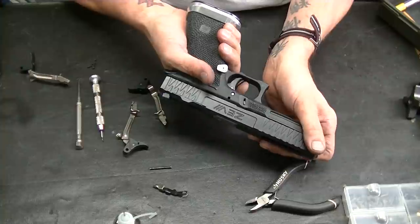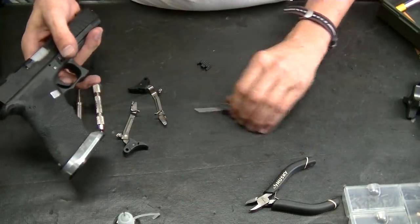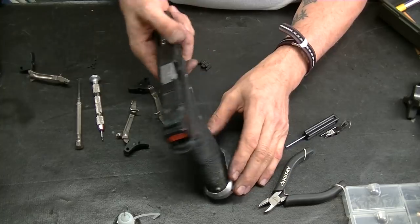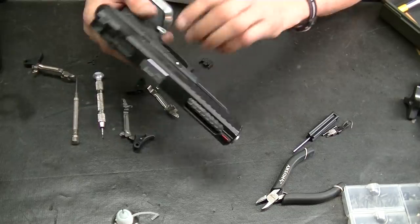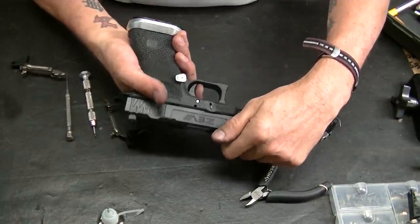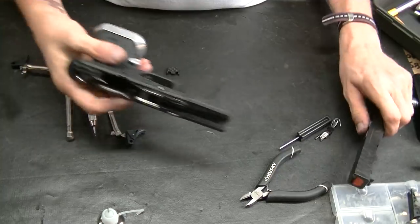What we're looking for is a quick break — there's a little nudge right there and then a quick break. Now, is that nudge enough to keep this gun safe? When I'm doing this with a lot of guns I just put one of these on just to make sure we're okay. If I drop — if I hit that — okay, it held, but it might not hold every time. There it went. So basically this is an unsafe trigger and we have to start over. But the thing is I really liked the action on this trigger.